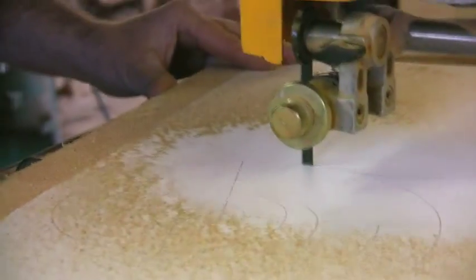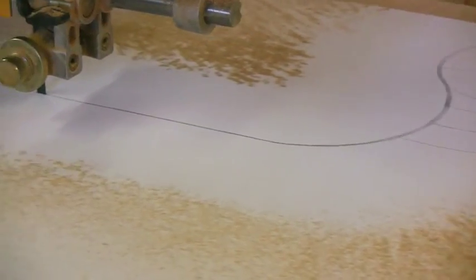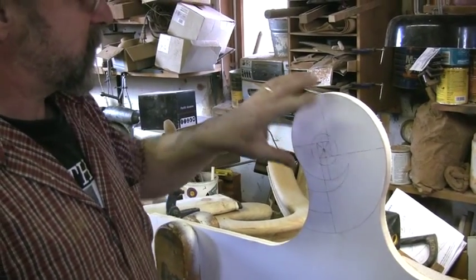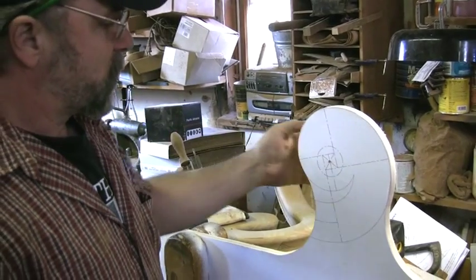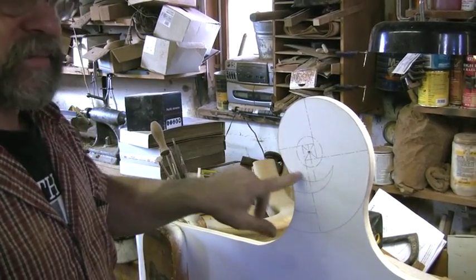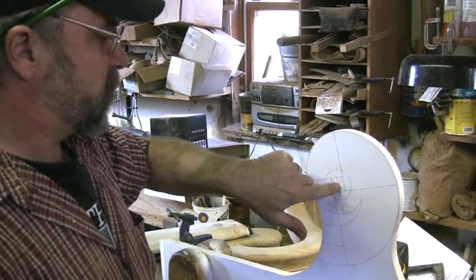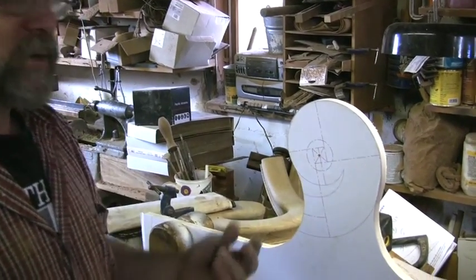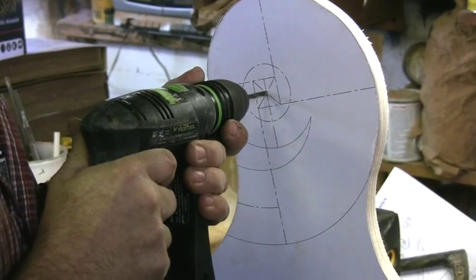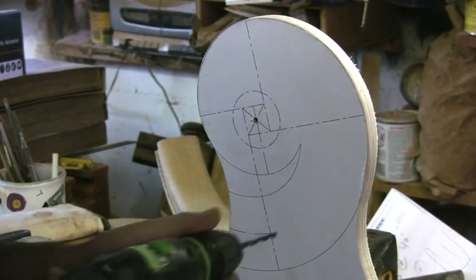We're going to go ahead and slide it down. I'm going to drill a hole right through this point here, and we're going to use a screw through this hole to fasten the level part of the volute to the jig. It's important that I go through this hole because this hole is actually at the focus of the spiral — it's the center point where the spiral goes right around and disappears. And that's going to be where my volute newel goes. We're going to use this point to locate the one-inch hole we drill in the bottom of the volute to catch the volute newel. Then I'm going to drill another series of holes on the center of this just so we can screw this thing really solidly down.